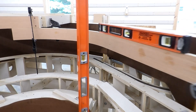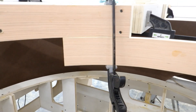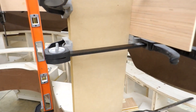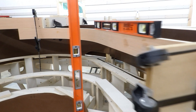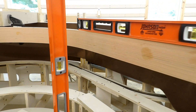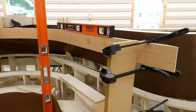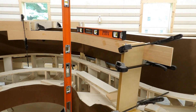This is how I worked out where the next piece of framing goes. I deliberately made this curve longer than it needed to be so I had some off cut — it also meant that I can overlap it and clamp the two together. I ripped that board to six inches wide so I know I've got exactly a six inch setback, and then I just kept adjusting it until I had six inches off the level. So now, other than the fact that it's three and a half inches too low, that board is in exactly the right place. So I can now temporarily install the opposing framing over the top of it and then get everything cut to length. Let me get on with that and I will be right back.